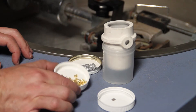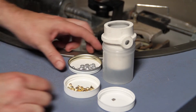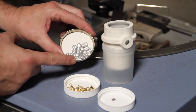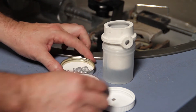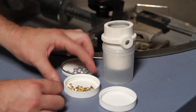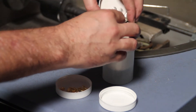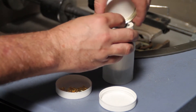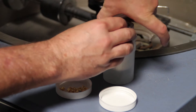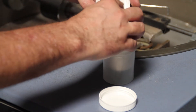Here's our ingredients. It's 80% gold, approximately 20% very fine aluminum, and this little tiny bit of platinum family to help it melt. I'm going to put the aluminum on the bottom, then gold, platinum, gold, platinum.